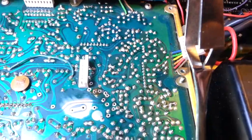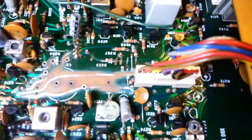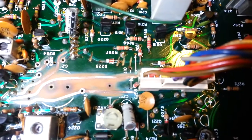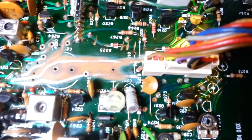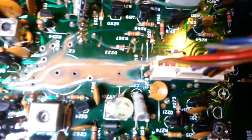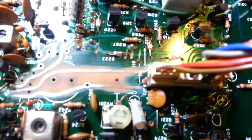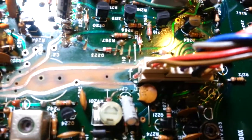On this side — the side that had the capacitor on it — it's going to be the worst, but it actually cleaned up fairly nicely. Don't have to actually replace any of the traces. You can see the residue where it leached out, but pretty much just had a slight bit of oxidation on all those traces, and got all that cleaned off.